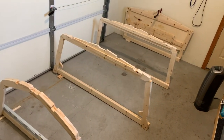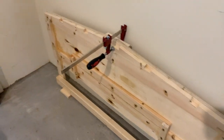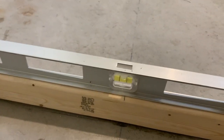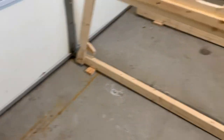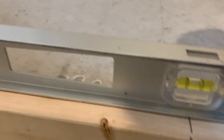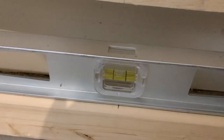It's about as far back as I can get to show all four — the three frames and the transom — in place. So I'll go back to frame number one. This is what I meant by just putting a little shim on that side. They're screwed in place on each frame and on the transom. If I come down to the bubble, it is level. And it is level on all of them. Number three is level. And the transom is level.